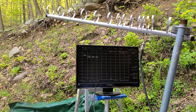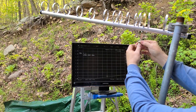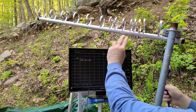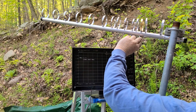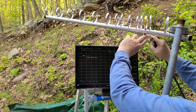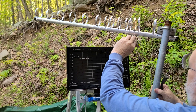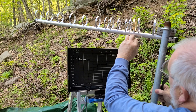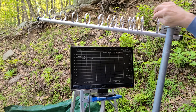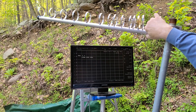At this point we're finished. On this rear-mount antenna, the coax is going to bend backwards. What I always do is take these two fingers and let my middle finger be my bending guide — that prevents the coax from bending too sharp around that corner. I just bend it back towards the mounting hole and then drop a screw through the mounting hole. On our round antennas the mounting hole always has a circle drawn around it, and you do not put a reflector on that — keep that one open for the mounting screw.